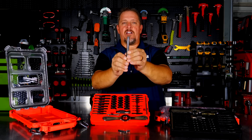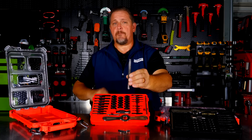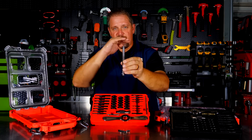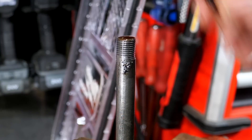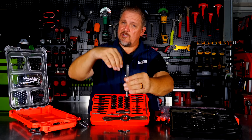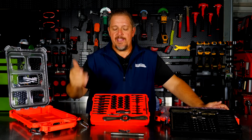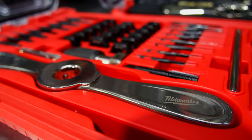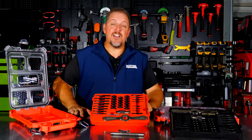Even when I was threading the rod, if you look, the threads are actually crooked — you have to be absolutely sure you're nice and flat or perpendicular when you start. That doesn't matter whether it's a Milwaukee, Irwin, or Snap-on tap; once you get threads started crooked, they're not going to straighten out. Great kits overall — I love the Pack Out integration, especially if you like the Pack Out system, and you can take the tray out if you don't want it. These should be releasing in the next few weeks — I think the ship date is around the beginning of September. We'll have a link in the description. Keep track of us on Instagram, Facebook, Twitter, and TikTok. Hit that like and subscribe button, and let us know in the comments what you think!